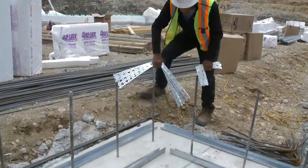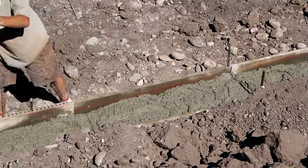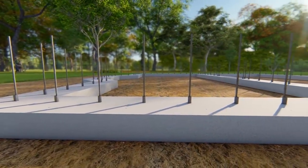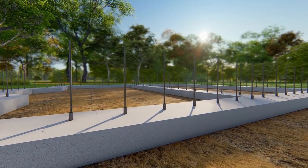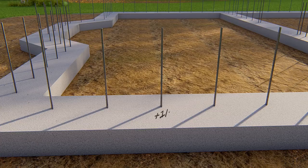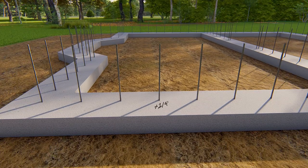Good preparation and job site organization are key to an efficient and high-quality build. Footings poured to within 1/4 inch of level will make the job much easier. When pouring footings, trowel the edges smooth where track will be laid. Clean excess concrete from around cleats that may obstruct the track. Use a laser level to confirm accuracy of the footings. Note variation on the footing with a felt pen or crayon. Ensure that footing dowels are installed per plan.